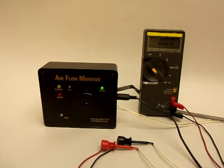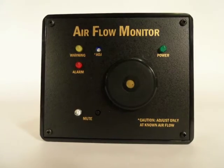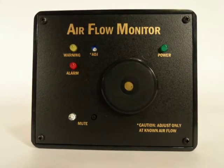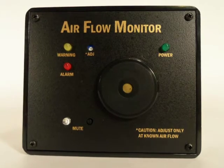Choose the configuration that best suits your external alarm application. The relay rating is 30 volts at 1 amp. Exceeding the rating can damage the relay contacts. Also keep in mind that inductive loads may produce transients that can exceed the contact rating and may also result in relay damage.